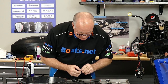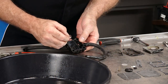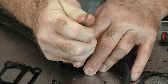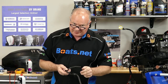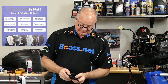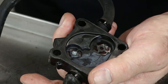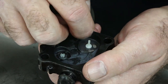Let's go ahead and get our new check valves in there. They don't feel quite as crunchy as those old ones. Let's go ahead and press them in. Now according to the manual, you push this in and it'll stop, then you break off the ends. The way mine went in, it went in like it was supposed to and flared out the other end to where it holds it in place, so there's really nothing for me to break off. You can see where the one I took out was not sealing very well on this side, so it's definitely time to replace. It's covering it much better now.